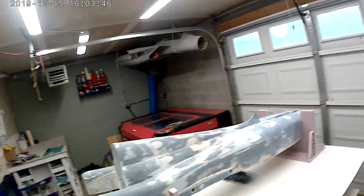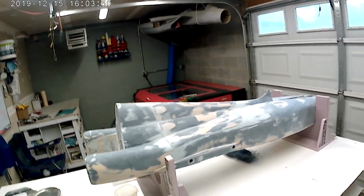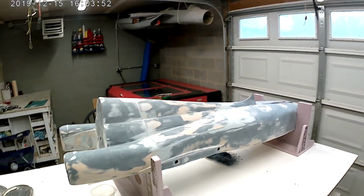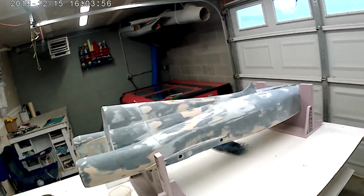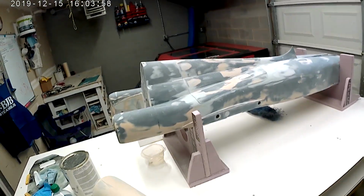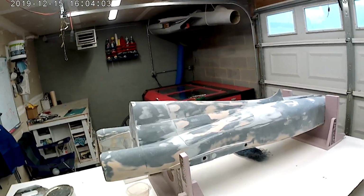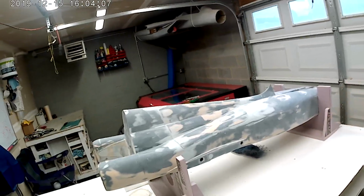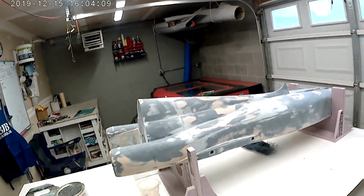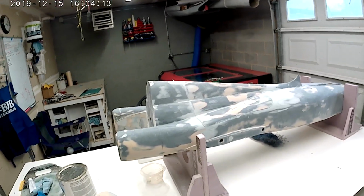The entire plug is 3D printed. I think we used about 30 kilograms of material, 40 kilograms, something like that. Whole thing's 3D printed, then the individual segments are just CA glued together, which works out really well. 3/4 inch pipes run the full length of the fuselage. I believe there's 5 of them for the fuselage, 3 for the nose, and then just 1 or 2 for each wing panel.